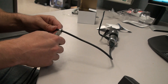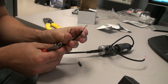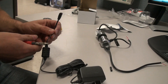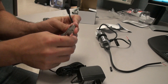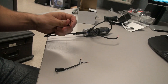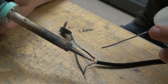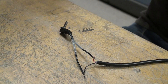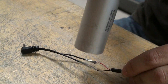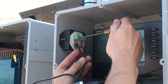We can take a spare USB cable and cut it, then separate out the red and black power wires — these will be your 5-volt DC power wires for your console. Now we can cut the supplied AC power cord adapter off and connect it to the USB power wires. Connect the 12-volt leads to the charge controller battery terminals and the USB cord to your weather console.